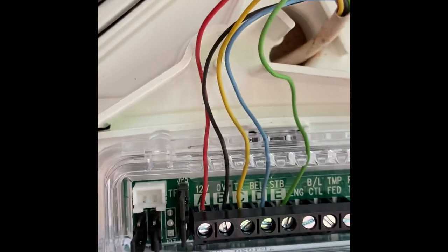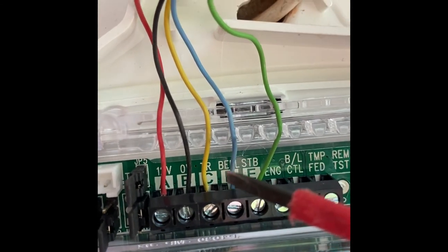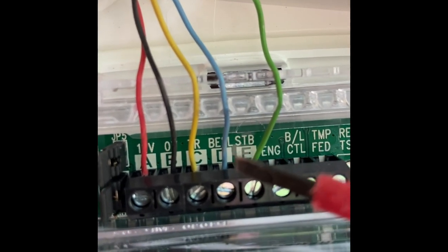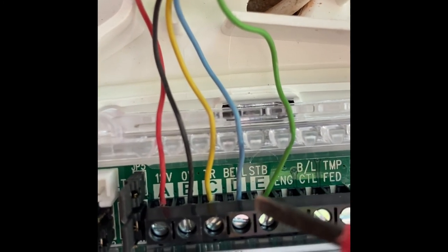Right, so I've got the bell box wired. As you'll see, I haven't used ferrules because this gap here is probably about 6 or 7 millimeters. So what I do is I actually tin the end of the cables before I put them in. If it's in the panel, I'll put ferrules on; on the bell box I'll just tin the ends, just so there's no feathery bits, etc.